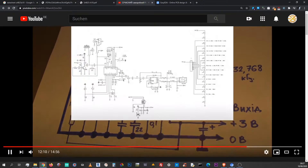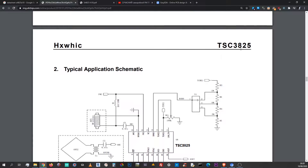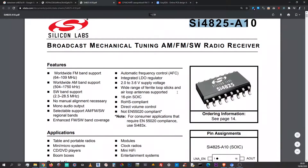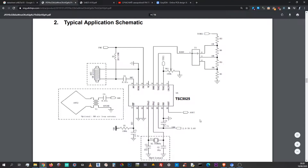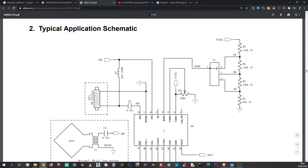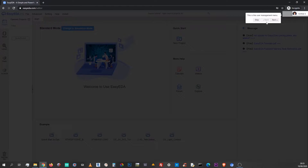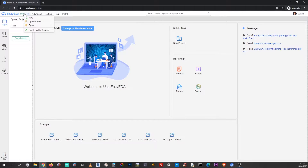So I thought it would be a nice exercise to build a PCB for this thing and to support his effort in this way. There are actually two chips that come into question, but they are identical and you can source the one you get quicker and cheaper. Alexander leaves the optional crystal in place and omits the AM antenna — I wonder how it would work without both. Maybe I can turn it into some kind of unstable receiver for artistic purposes.